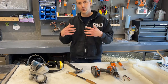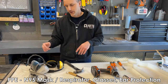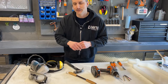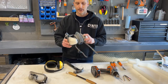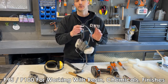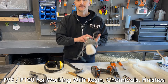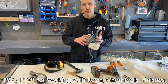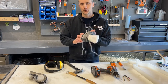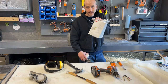If we're talking about working with wood or resin in general, PPE is really important — whether you're cutting, sanding, mixing, or pouring resin. It's 2022 when I'm making this video, so you probably already know what an N95 mask is. But you're going to need either N95 masks or something like a respirator. This is a P95, which handles particulate matter, odors, and toxic chemicals — helpful with resin and high-VOC wood finishes. A P95 respirator is what you want versus a standard N95 mask, though replaceable N95 masks will also work.